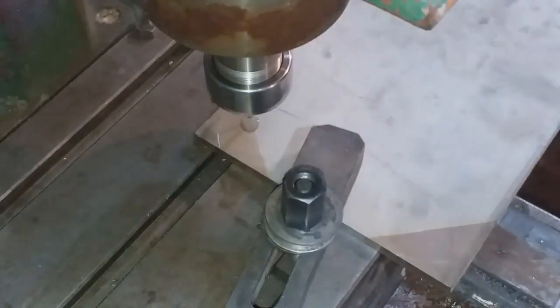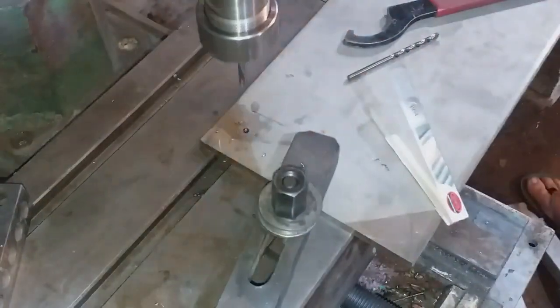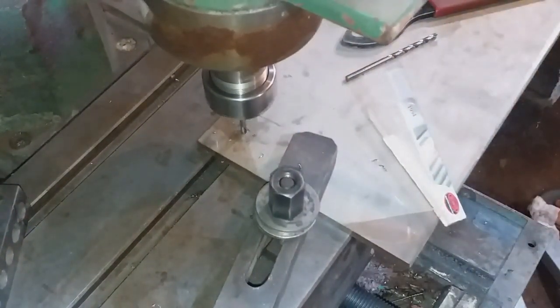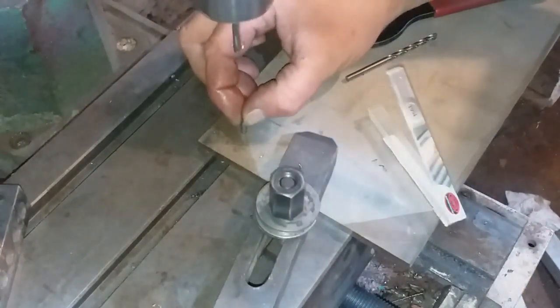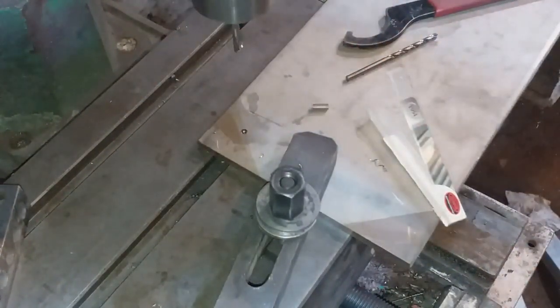So, again with this, I start off with the main pivot. It's the most critical point on the knife, and everything's gotta be just so. So what I do is drill it with a 3.8mm, ream it with a 4mm, and then counterbore it so that pin can't go all the way through. It's just sat in there, held nice and snug for a tight fit against the blade.